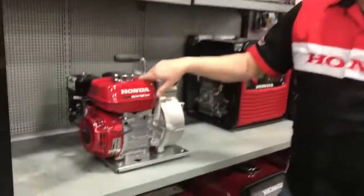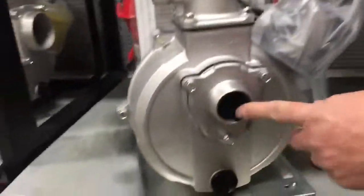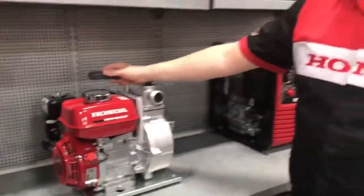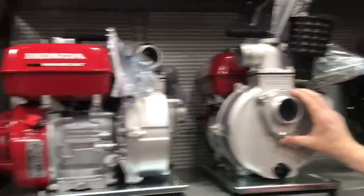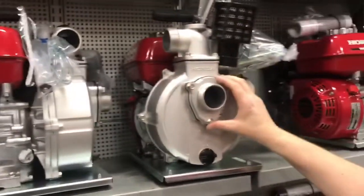In fact, the WH-15, which is a one and a half inch inlet and outlet, is your standard pump for wildfire fighting — very popular with the rural fire departments. It also comes in a two inch version, which is very popular for firefighting and for people that need a high pressure application such as commercial irrigation systems where you're pushing a lot of water through a narrow aperture.